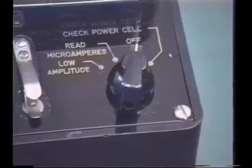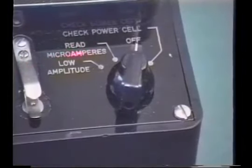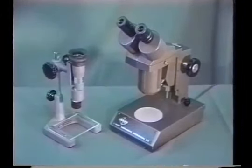The meter can provide 2 different voltages, a full battery voltage of 1.35 volts for running and a lower voltage of 0.95 for phasing. Phasing is a process of synchronizing the indexing mechanism. A microscope of 20 or 30 power with at least a 2-inch working distance is necessary when straightening and prepositioning the index and pawl fingers and jewels. It is also necessary for phasing and especially when adjusting the index guard.